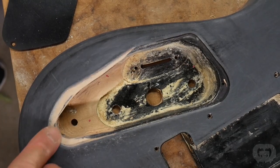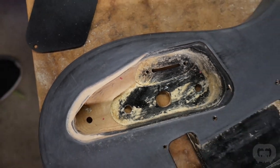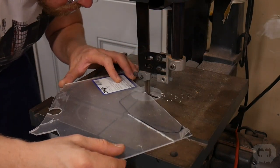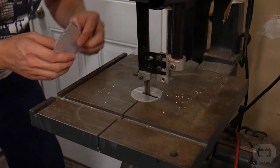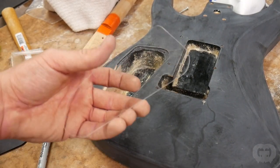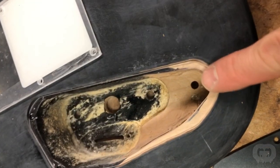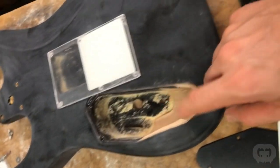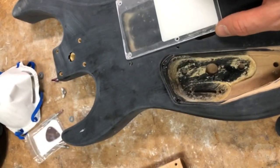I think we got what we need and it's time to move forward. The new cavity turned out great — it's got a nice shelf for the screws to mount and plenty of space in there for the boost switch. The next step is to make a new cover for it. I had some clear acrylic laying around that I thought would be perfect for this guitar. I'll throw a couple LEDs in with the wiring and it'll light up the back cavities when you flip the guitar over. These are the little details that make a custom guitar really shine — literally. So here I got the cover on, drilled all the countersunk holes, and it fits beautifully.